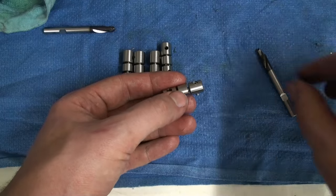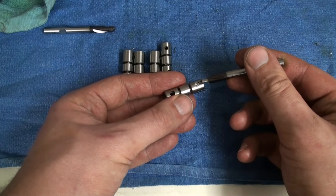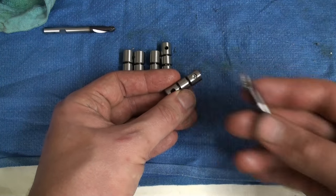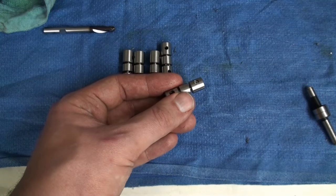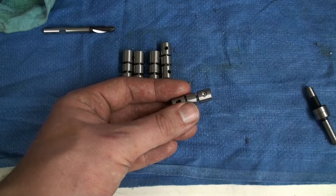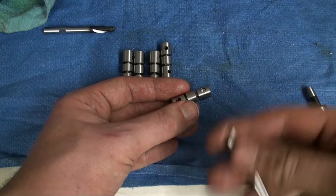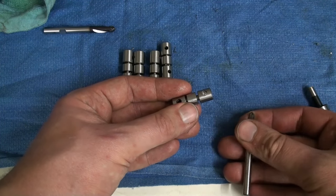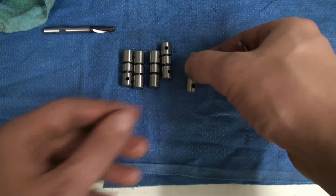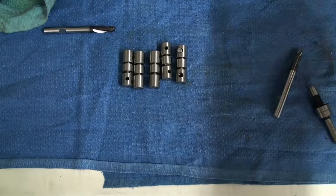And the main reason why I do this is so I get as much material left and right of the screw hole as possible. And I think that's the best solution. I didn't want to drill through from the other side of the sine bar into the rollers because I wanted the top surface of the sine bar to be without any holes.